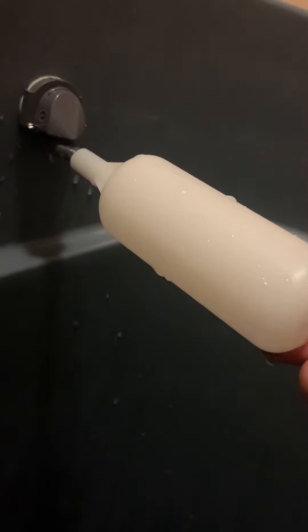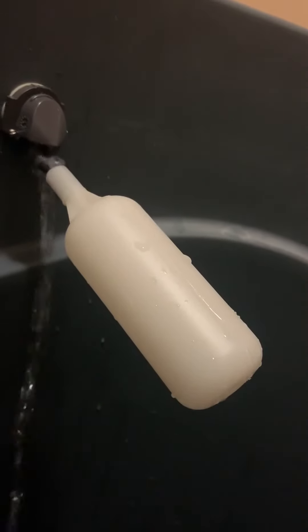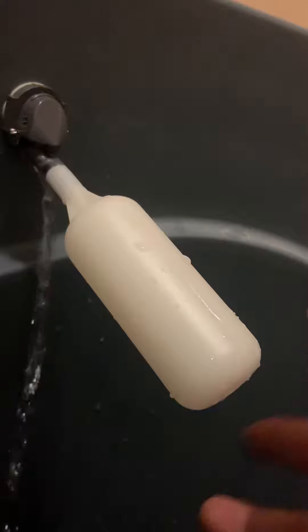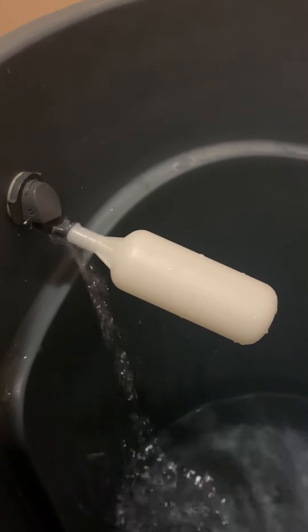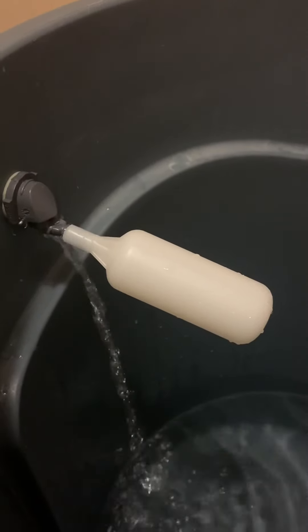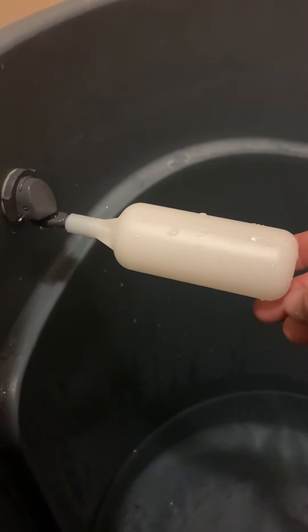Use your water and it turns right back on — very simple. First time you do it, check for leaks. That's how I found out I had the beveled washers on backwards; just flip them around and you're good to go. As you can see, it's no different than hitting the shutoff on the sink and no water is leaking out.